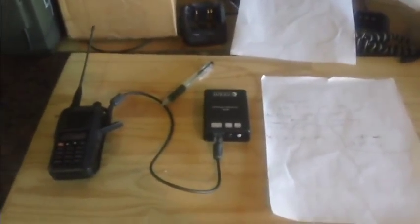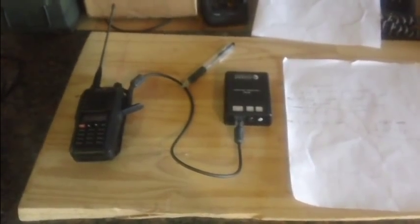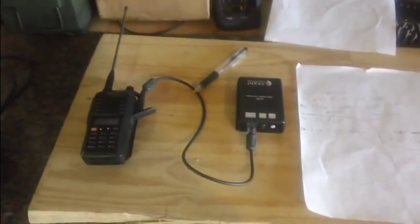Since I'm going to be using a GMRS frequency to work with this system, I've picked the ham channel, UHF band, to replicate what I'm trying to do with the real final product when I go into deployment. Within the UHF ham band here in Northern California, there's somewhat of a gentleman's agreement of a band plan. A band plan is an allotment of the frequencies that are allowable to hams to operate in, separated between single sideband, experimental, slow scan TV, repeater inputs, repeater outputs, Simplex communications, and also calling frequencies. Those are all chunks of frequencies or single frequencies that are already allotted for a specific task. So I'm going to follow that so I wouldn't interfere with anybody else.